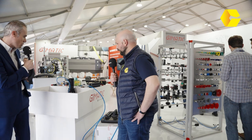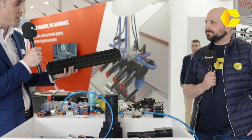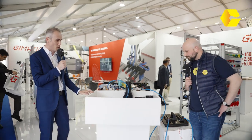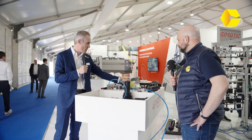One of the main topics we're showing is foam grippers — basically extruded aluminium bars with vacuum generators inside, provided in several shapes and dimensions, used to grip different parts on regular or irregular surfaces. The bench we have here lets customers directly see and test our suction cups and pumps in direct contact with their own components, like cans or potatoes or bags.